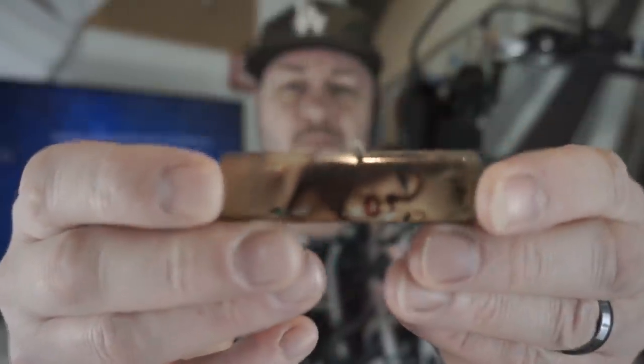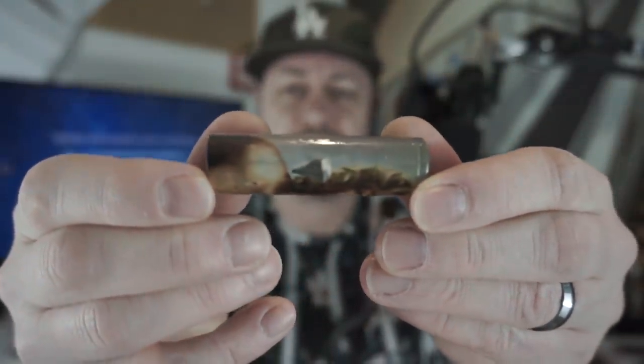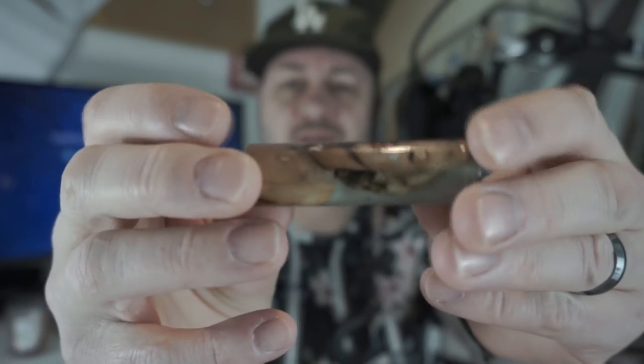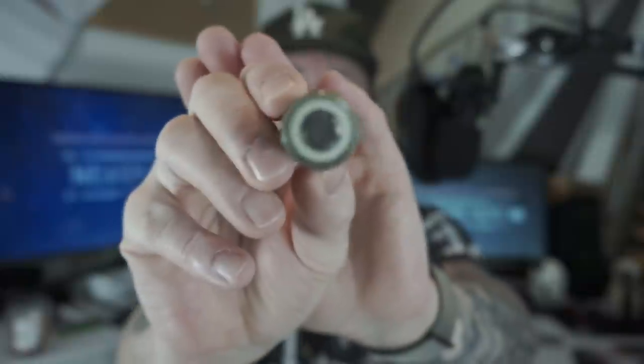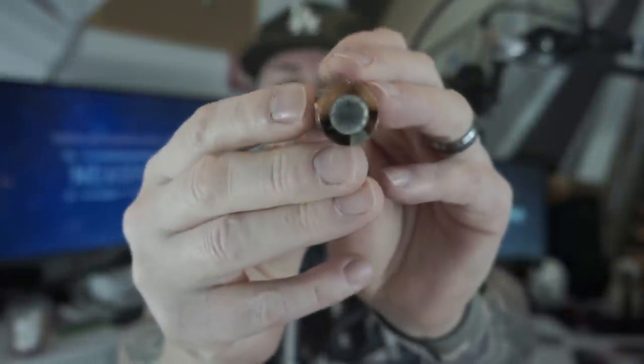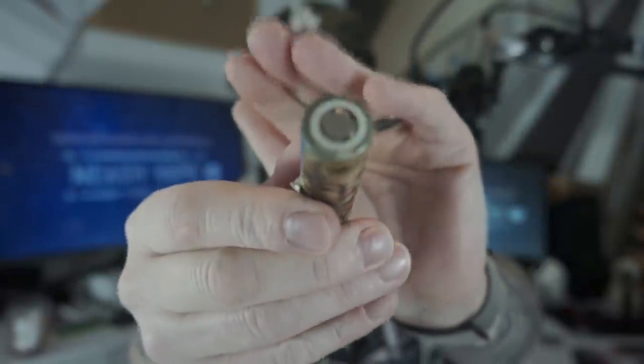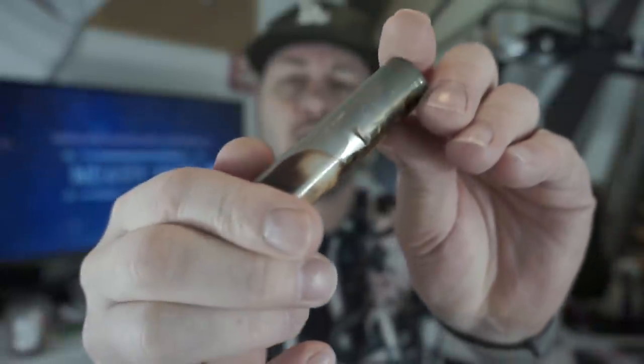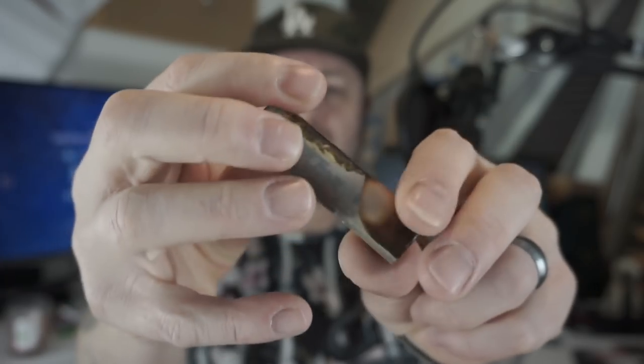If you can see tears in the battery, little nicks, little marks, see a little one at the top there, hopefully. That is a poor battery wrap. Any slightest tear, mark, showing of metal, swap it out, change it.